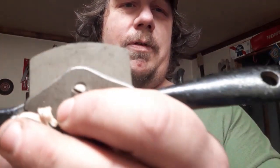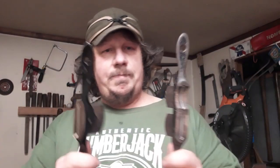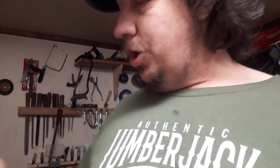These are just stamps on the blade itself. Stanley 151 — stay away from it unless it's an old one without these adjuster knobs; you're not going to like it, you're going to get real frustrated. I know because I've had this for years and every time I use it I get frustrated and toss it back up on the shelf. I should get rid of it, but as you can see I kind of like tools. You can sharpen all these with a combination stone, sandpaper, or little Arkansas stones.